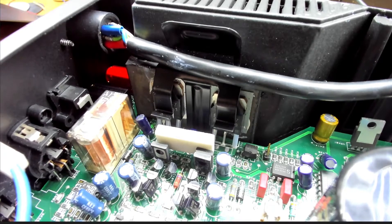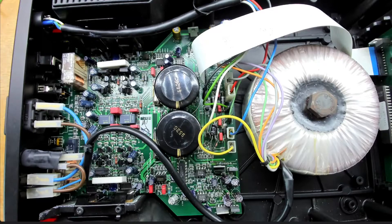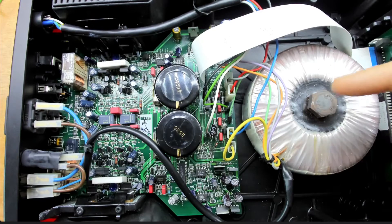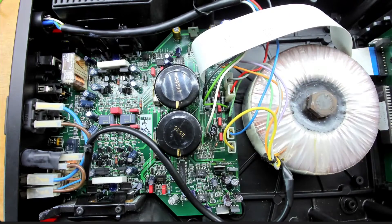There's definitely a smell of something going on in here, and obviously we've got this mess that we don't know is contributing or not. Let's reconfigure to standalone operation. It's very easy to go from PSXR to internal power supply - swap the yellow and blue, swap the red and gray, and that puts it into its standard mode of operation. Let's make those swaps.